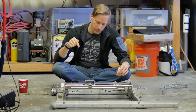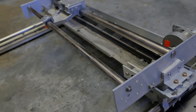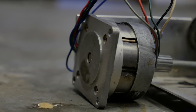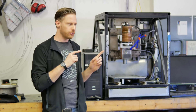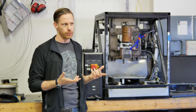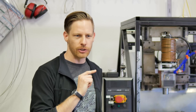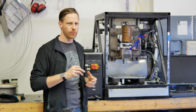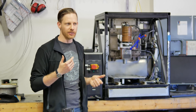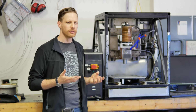I ended up making this, which is made out of industrial dot matrix printers that I got for free from a surplus shop. I don't know where the z-axis is — apparently whatever that was, was embarrassing enough that I threw it out. Once I learned as much as I could from this, I went on and built the second one. This is version 2, although it's actually probably like versions 2, 3, 4, and 5 all at once, because once we had a good frame, we kind of kept modifying it. We learned a lot with this — G-code and CAD and CAM and all these other things. What we didn't learn was chip load and milling in general — everything that wasn't digital — so we needed something a bit more analog.